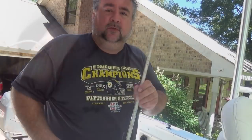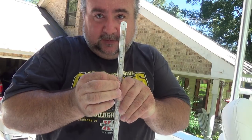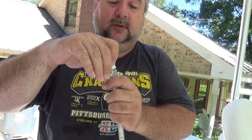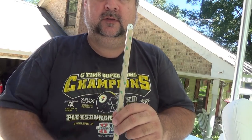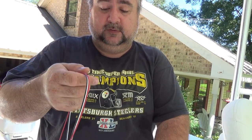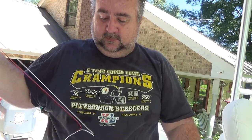Apparently none of that was filming. What you missed was me sliding the LED strip up into the groove. The end cap was not in there yet. I pulled the LED up into the track, and then making sure it's the right way around, I inserted the end cap. That's where the set screw is going to go. I'm going to move the LED all the way to the end — you can see on the back there's some peel-off tape for 3M adhesive. I'm going to use that to stick the item underneath there, then later put the set screws in on both sides. Right now I'm going to separate these wires, as it says in the instructions, so that the end cap will fit.